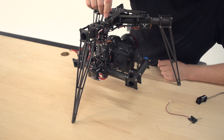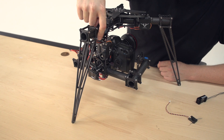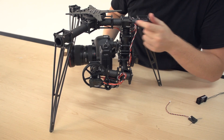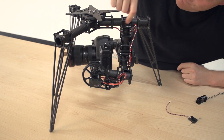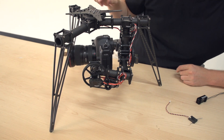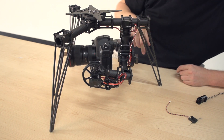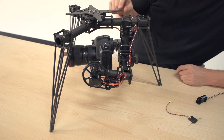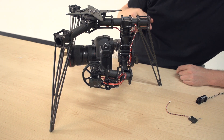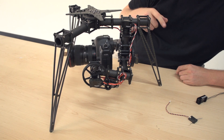Let's talk through a Futaba connection real quick. We've got a little Futaba SBUS receiver right here. We've got an SBUS lead coming out, and that snakes right over to the pan module on the Radian. From here we've got a servo drive out to the pan servo from this Radian, and then we've got a lead coming down to the roll Radian.